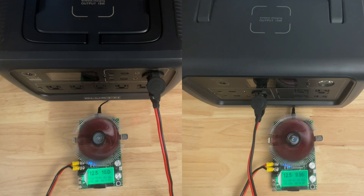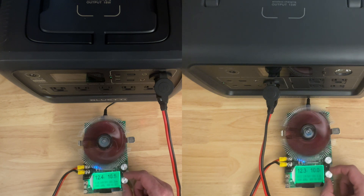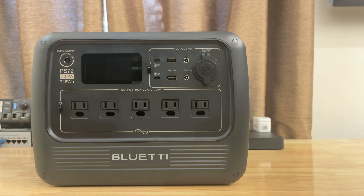Where things are a little different between the two devices is the cutoffs. There is a very hard cutoff on the EB70S with the cigarette lighter port — when you get to 10.1 amps, it cuts to zero and shows a short error. With the PS72, you have a little bit of a grace period until about 10.4 amps before it cuts off. The cigarette lighter jack is only rated for 10 amps, so it's a good thing it doesn't let you pull too much. But it is nice that the PS72 has a grace period in case you have something with a startup surge, like a diesel heater, where those devices need a little more power to get going.